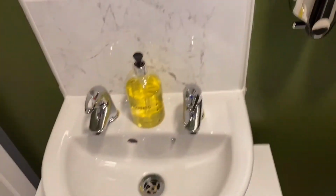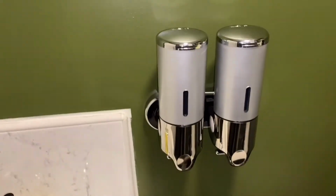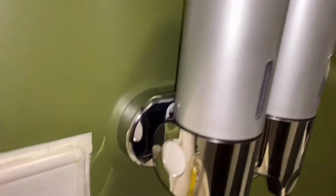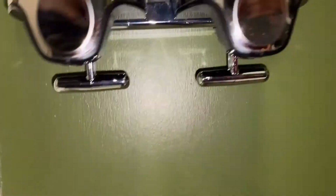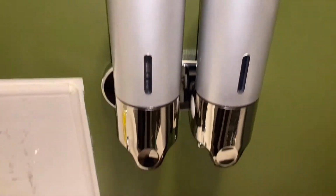This is not an electrical component, but say perchance you were trying to drill through a tile. You would need a center punch or a nail to indent the tile, but prior to drilling the tile, you would need to protect the tile with masking tape to prevent splintering and to prevent the drill bit from moving off of its center when drilling through the tile and through the wall.